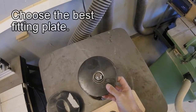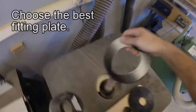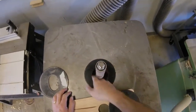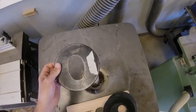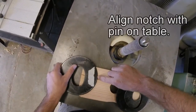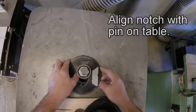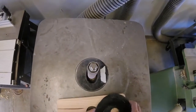This one is obviously too small, and this one would be too big — your fingers would fall down, your work would fall down inside there. So make sure you have the correct piece on there. Also notice there's a little cutout right here; you can see it matches that little pin right there, which prevents the plate from turning inside when the machine is on.